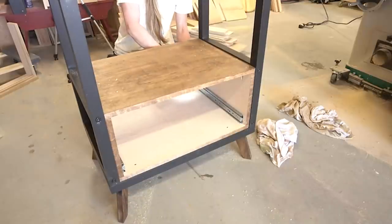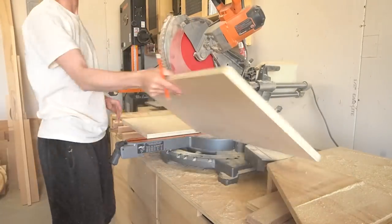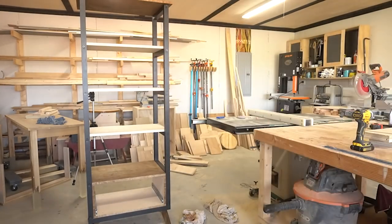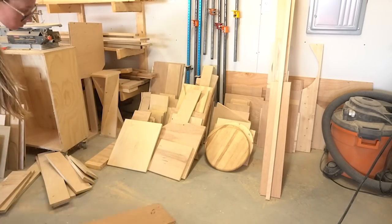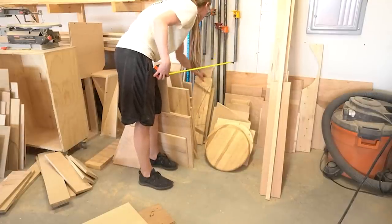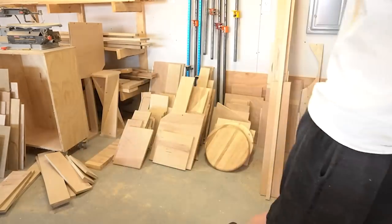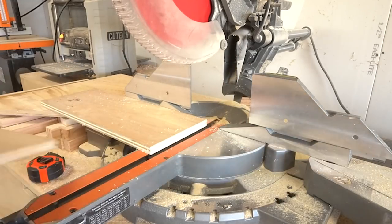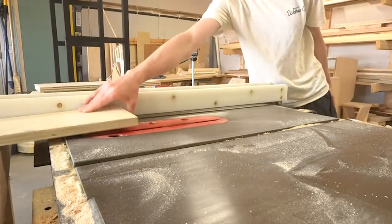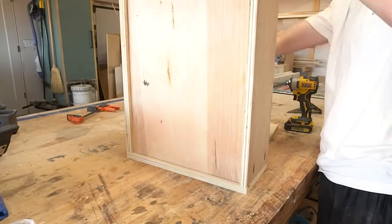Now all that's left is adding the drawer and the shelves. The shelves were pretty easy — I just cut my plywood strip into three shelf pieces and applied edge banding to cover the edges, then test fit them to make sure they worked. I didn't want to cut into a whole other sheet of plywood for the drawer, so I went to my scrap pile — which I had just reorganized and cleaned up, a vast improvement over my last scrap wood video. I picked out a few pieces to make the drawer, cut them down to size, cut quarter-inch dados for the bottom to go into, and assembled the drawer box using pocket holes and screws. I have a complete drawer building guide on my website linked below.